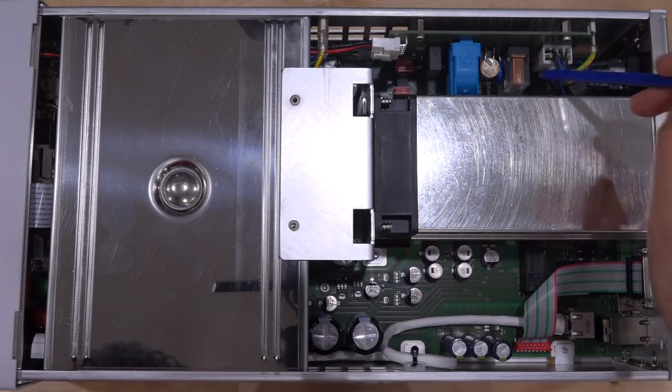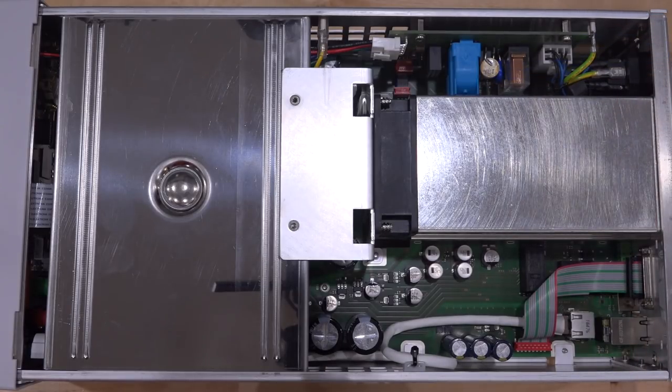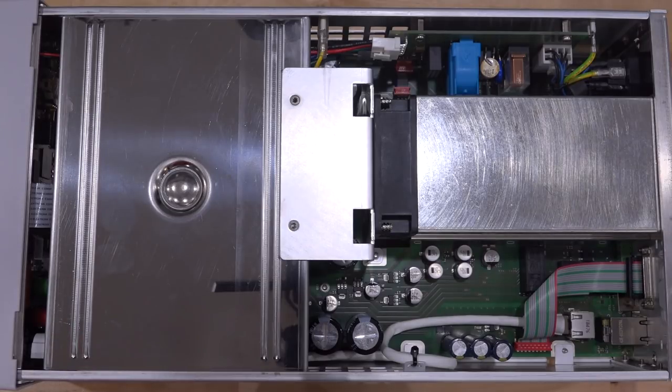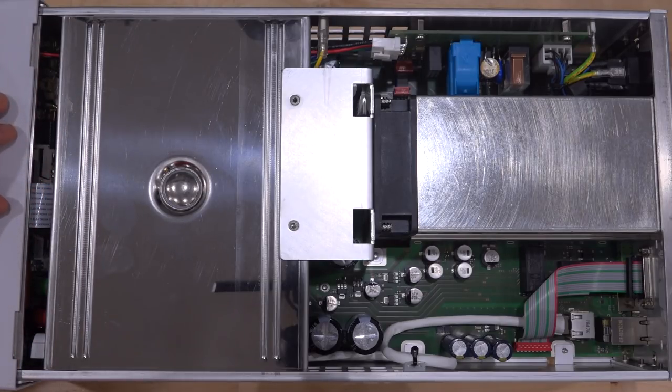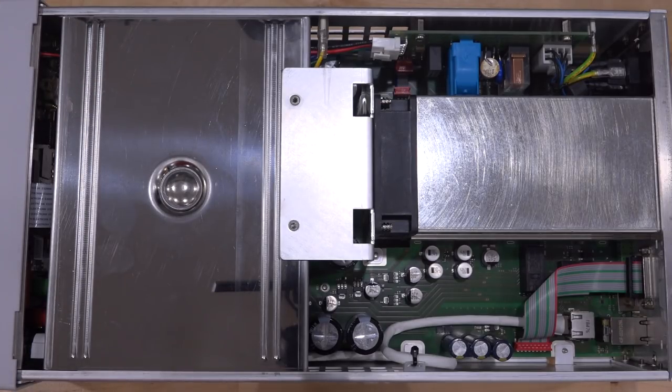Underneath, there's a Cyclone II Altera FPGA and a Microchip microprocessor handling all interfaces between the front panel computer and everything else, controlling all the analog devices. This is a very common approach — as application processors became cheap through consumer electronics, more test and measurement vendors are creating a full computer in the front panel. It handles the GUI, signaling, and all processing, communicating with the main board. This remains constant across a wide class of instruments — a cost reduction and uniform GUI design.